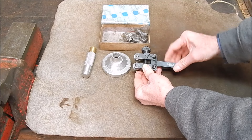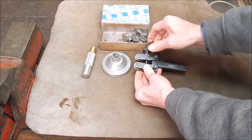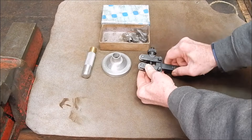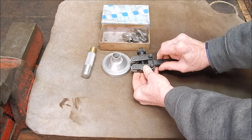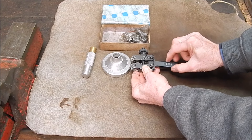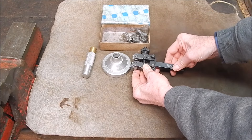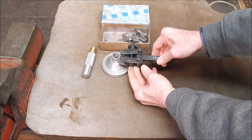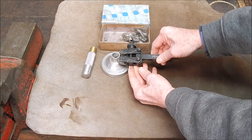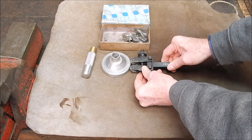On a plunge knurl, you've got two rollers — you can have one in some situations, but most come with two — on a pivoting head, with pivots on a centre shaft on a mounting block. There's no reason why this can't be used as a plunge knurl and push in on the job, just by applying force. The beauty of it is you can also do big diameter stuff with it.